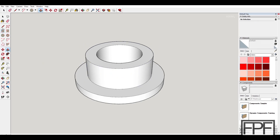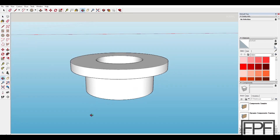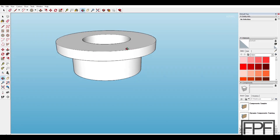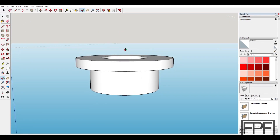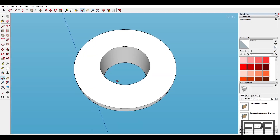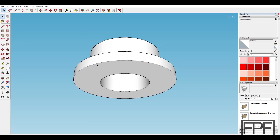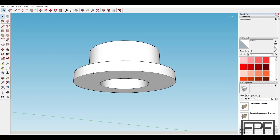Let's clean that up. That's starting to look like our final piece — it would actually work just like this, but we're going to pretty it up. There's no reason we can't do a bevel on the outer face, and some bevels on the inner edge to make it easier to use. This face here is going to print face-down, so we want to make sure we do a bevel — not a curve — so the printer can handle it without supports.